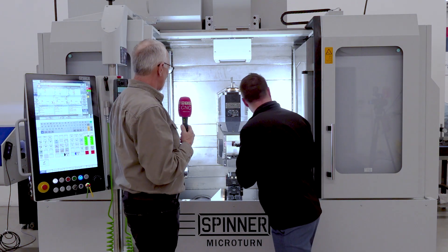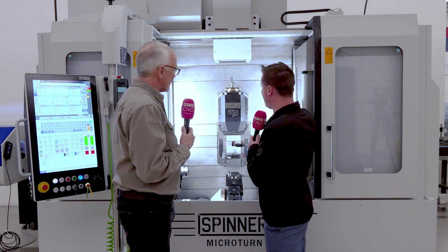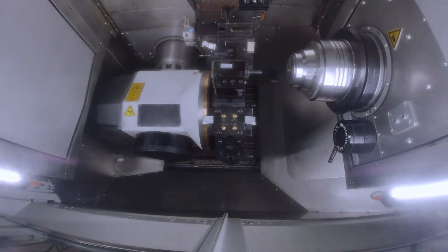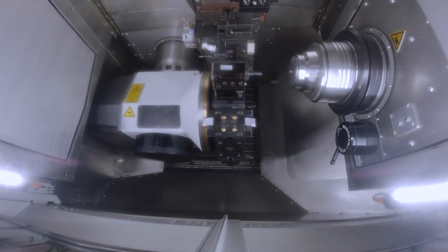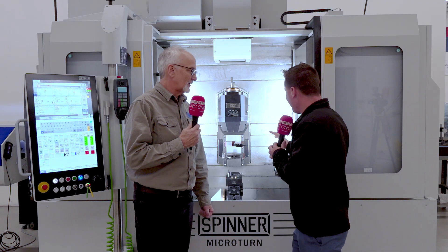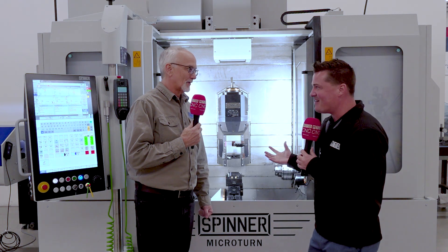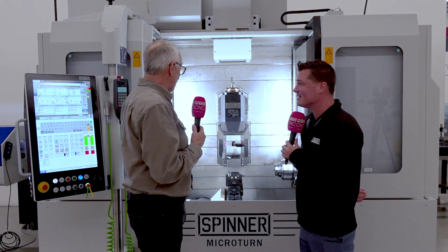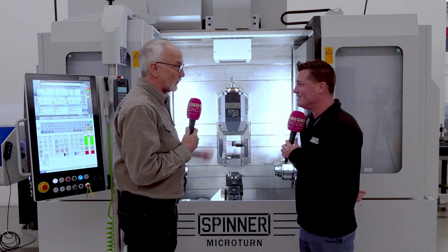Something unique here, Brian — it looks like both the main spindle and the sub-spindle go up and down. On this machine, both spindles handle the X and Z-axis, so all the diametric tolerances and lengths are handled by the spindles. Y-axis is handled at the turret and the B-axis. And yes, you can bar feed this machine — spindle-length bar — and when you're dealing with the kind of accuracies we're working with here, that's probably your best bet anyway. Looking at it, it seems compact, but you can fit up to an 8-inch chuck, and you can also do full 5-axis machining on this machine.